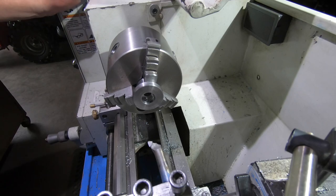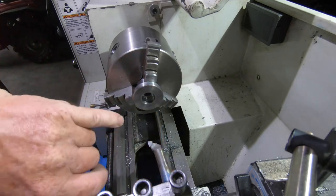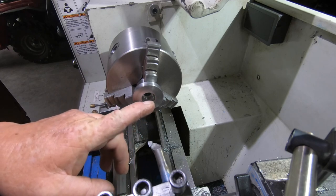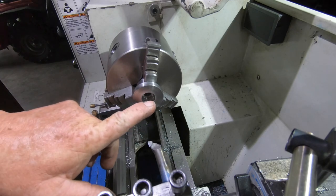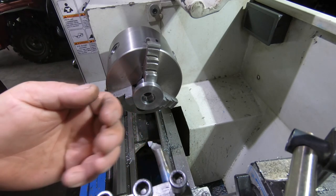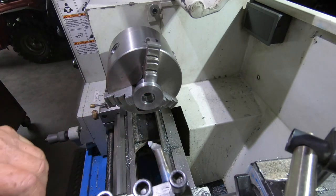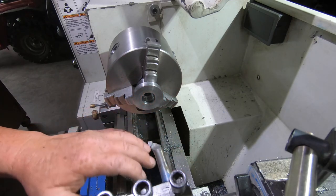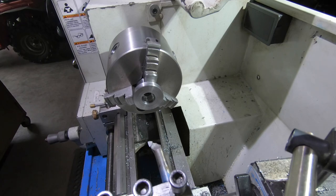Well, here I am talking away to the camera and it's not even recording. I screwed this bore up a touch. About 3/4 of the way in, I advanced out a bit too far when I was machining the end of the bore and went a touch deep. But anyway, it's at 16.3 now, which gives the head of the bolt a bit of clearance going by the dimensions I've got.